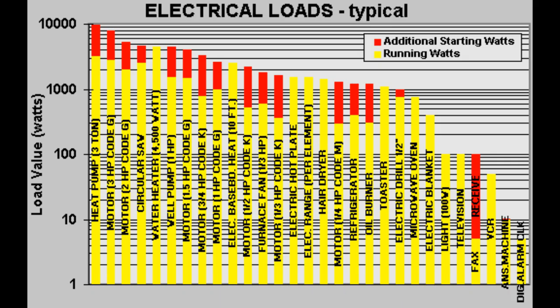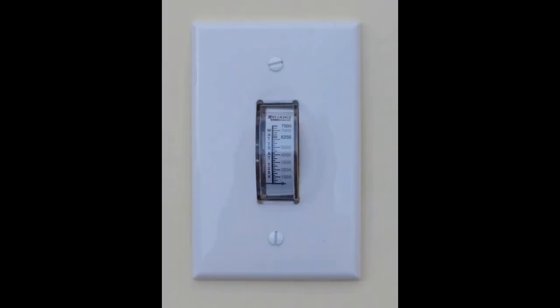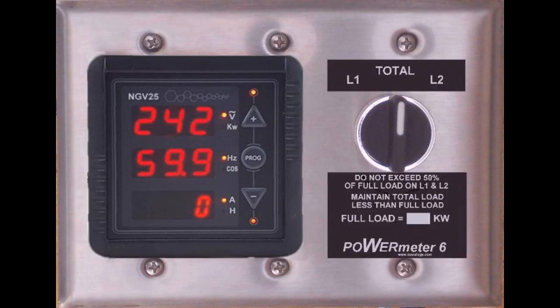Step 6: Turn on essential circuits one at a time. It is just as easy to switch back to utility power once it has been restored — just reverse the same procedure. Note that depending on the capacity of your generator, large electrical loads such as a water heater, clothes dryer, range, space heating, heat pump, or central air conditioner may not all be able to run at the same time. Therefore, we recommend installing generator metering so you can better manage the load and avoid overloading your generator.